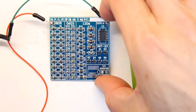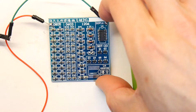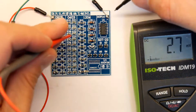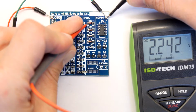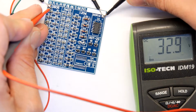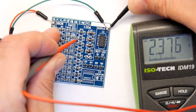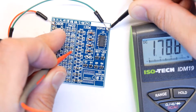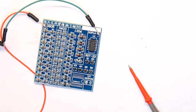Maybe, I don't know, what's the input voltage supposed to be? My supply is pumping out like 30 volts, and that whole thing's not really doing anything. Interestingly though, it's really quite confusing. Hang on, am I losing my mind? 32 volts. By the time you get here, it's 2.4 volts. Maybe there's just no current in this bloody thing. The meter's telling me it's using 4 milliamps, so I don't know. Maybe you can't get the bloody thing to go.